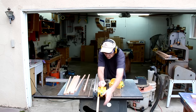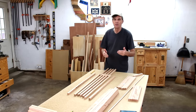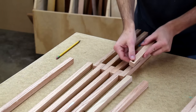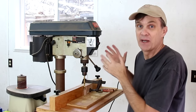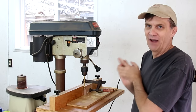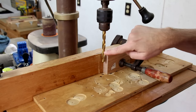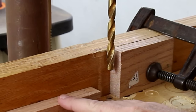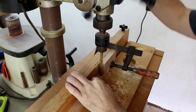What I want to do is drill all the holes that hold these pieces together at the same time so that they're all in the exact same spot. I have a feeling this is going to get a little bit tricky. You pretty much have to have a drill press to do this. By positioning a stop block right next to my drill bit, I'm giving myself a fighting chance of having some accuracy when I drill holes through the ends of each piece.